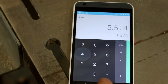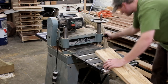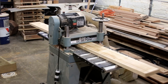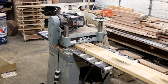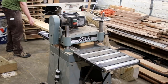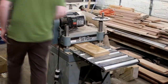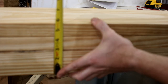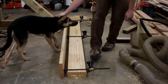The next thing I have to figure out is I have four pieces of 2x8 and I want to dimension all of those down so that they are 5½ inches thick. I'm just going to run them through the planer until I get them the proper thickness. Then I'm going to do a huge glue-up to make sure that everything stays together using screws. This right here is one of the more enjoyable parts of the project for me — the glue-up for the top beam that's going to hold all of the weight for the gantry.